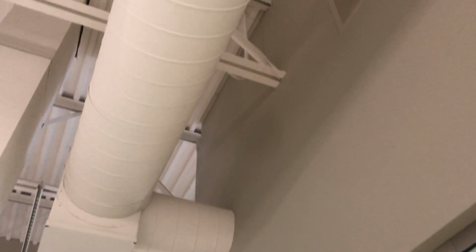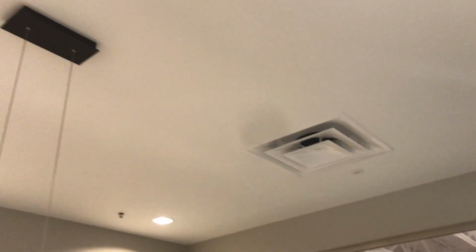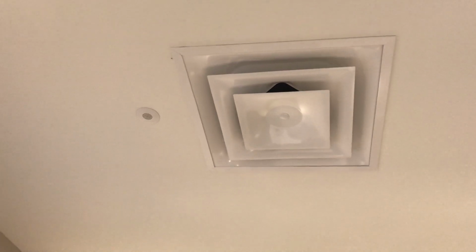Then we came around and hooked him through here to go to the conference room. As you can see, there's a speaker, and there's another one over on the other side. And the nice thing about these emitters, you can dial them down. So we dialed these down 6 decibels because it's a conference room with lots of reverberation.